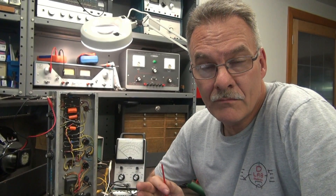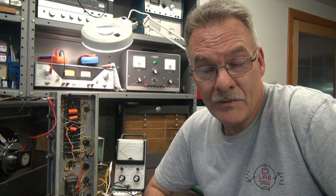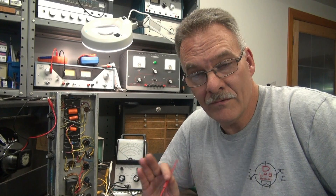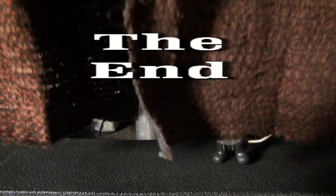I hope this shows you the value of these old VTVM meters. There's a bunch of them out there — you can find them at swap meets for basically nothing. Nobody wants them; they think they've got to have a digital meter. Well, guess what? You're not going to find these kinds of problems with a digital meter. Back in the day, before they had oscilloscopes, all the manuals for the old radios that were repaired and aligned were done using a VTVM. They're great level indicators — you used to use them to peak up IFs and peak up audio. They have great frequency response, so I highly recommend you pick one up. Oscilloscopes are complicated and kind of spook people, but everybody knows how to use a meter. A simply brilliant repair, D-Lab. Thank you.